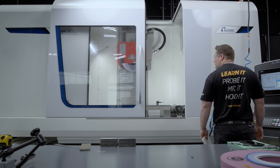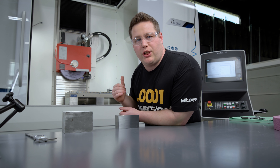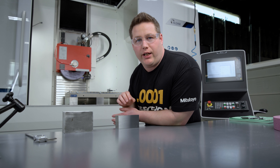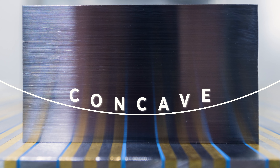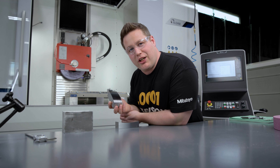We're actually going to profile a couple of pieces of 4140. A brand new wheel on this machine comes in with an 8-inch radius, so we're actually going to put a 12-inch radius on our two parts. We're going to put a convex radius on the first part and a concave radius on the second part — something kind of like this. So let's check it out.